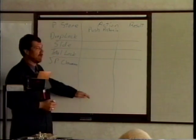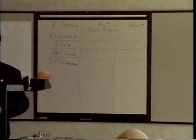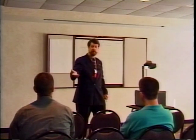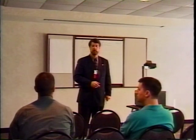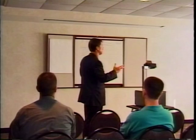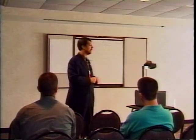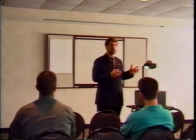And then it had all these different situations. The next one was push the L stone in, and then pull the R stone, pull the L stone, and then if you push both stones or if you pull both stones. And they gave you this chart, and this was all blank, and then they'd give you the Barkus model and say, okay, go study the escapement. And you end up memorizing. Eventually, after looking at all this, you understand what's going on. But for me, it was like, where's the connection between that and timing or the efficiency of the watch? There was never that connection of how they actually worked.